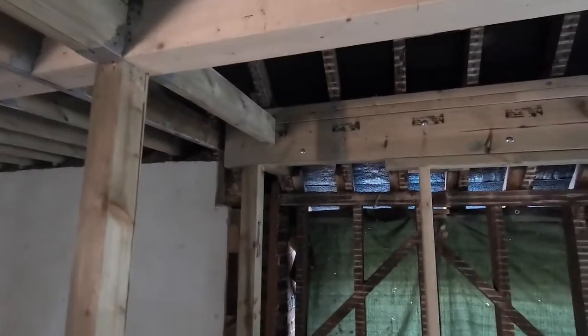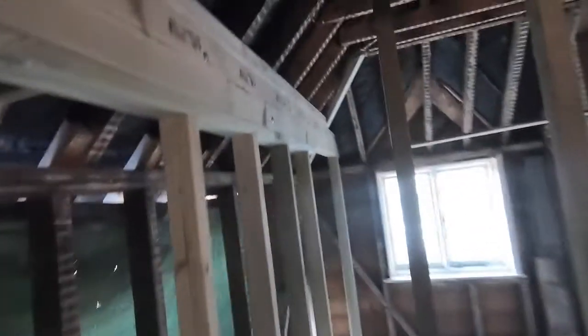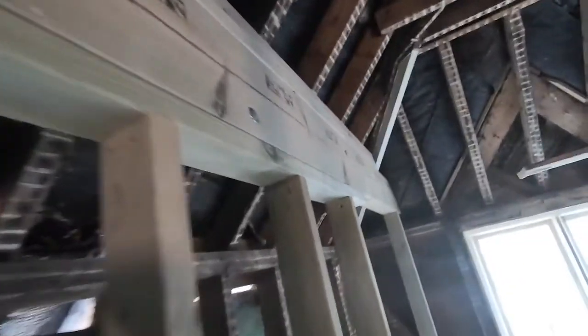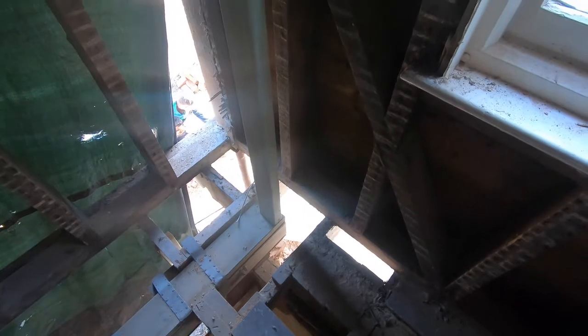But if you want to look at the Purlin, it basically sits with those two beams above it, and you've got these rafters bird-mouthed into the top. I'm going to poke you over so you can see what's doing there. But effectively they're just sitting on top of that new Purlin, and that runs the length over the steel, and then that steel just needs to have that plate welded on it, as you said.